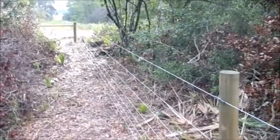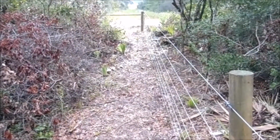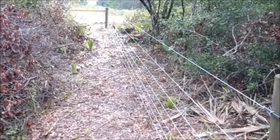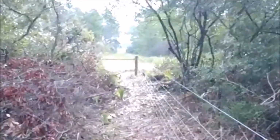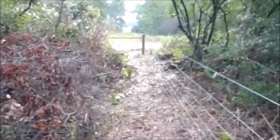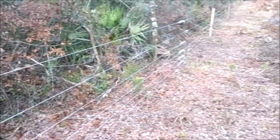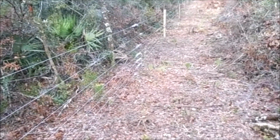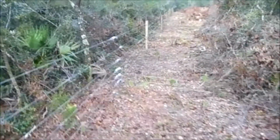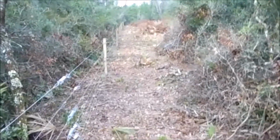Use full, I wouldn't think of doing anything less than a full 8-inch corner post with 6-inch H brace offset post and 4-inch diameter crossbeam. That's as beefy as you can pretty much get. That fence, when I ratcheted it down, moved, and I'm talking those corner posts that were at radical angles. They were angled, and it looked pretty radical when you looked at them sitting there 3 inches offset.